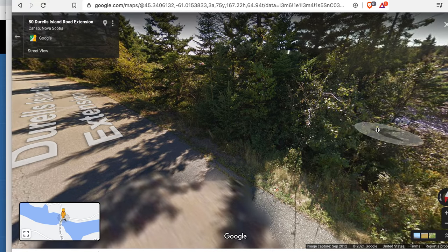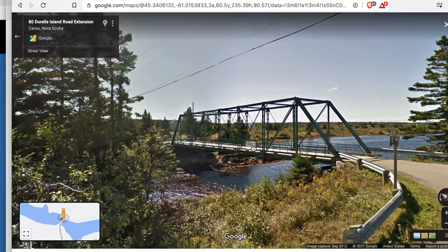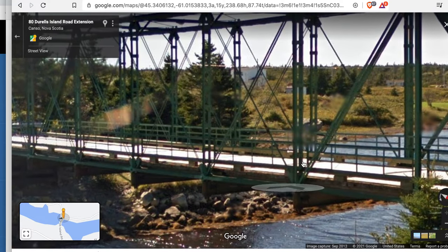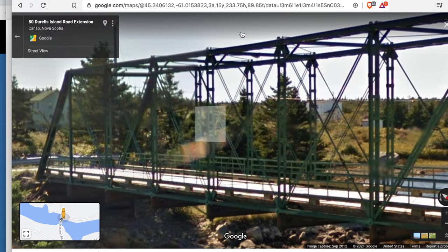There are the i-bars. Our loads are going - let's put a downward concentrated load right there off that joint. You try to pull it down, the chain is so taut it can't go - that takes care of the bottom. This is also redundant by pulling back up to here and back down. Same thing: put a load here, it tries to drive it down, this bar grabs it, puts it up to here. It's trying to drive it back down within the compression, and this one pulls it back again. Those loads are your transfer loads.